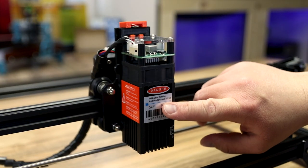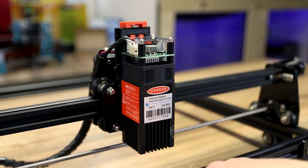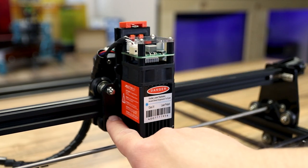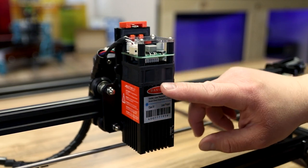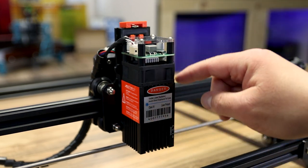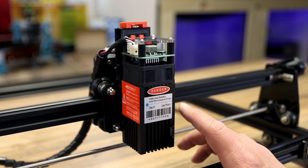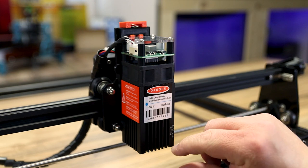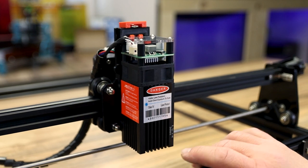This right here is the laser module. It is connected to an adjustable Z-axis upgrade that I did, and the link will be in the description below. It normally comes stock mounted straight to this plate and does not move. They do make a new version that's a fixed focus laser, which means you don't adjust the lens underneath — you just adjust it up and down. All the new versions are coming like that, which is really cool. You get this little metal spacer, you put it underneath, and you just adjust straight down to it — that's all you have to do to get burning.